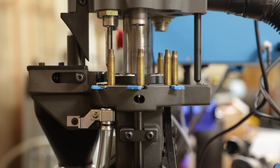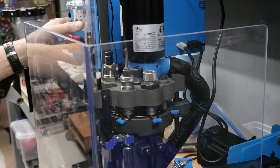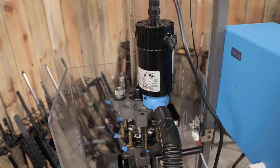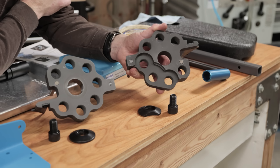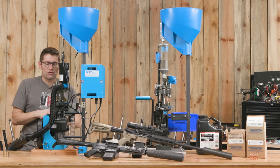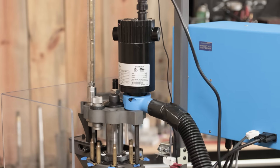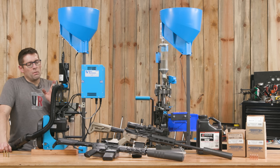Moving the swaging does involve taking the crankshaft out and putting the eccentric on the other side — not a real big deal. The reason I did that was to have better access for the vacuum suction manifold. I'm now in the middle of this cut-down section — the special lowered trimming head for the Super 1050 and RL1100 — which allows the entire trim die and trimming assembly to go down far enough to trim those short .300 Blackout cases. I also made a little slip-on adapter for the vacuum to connect and disconnect easily.